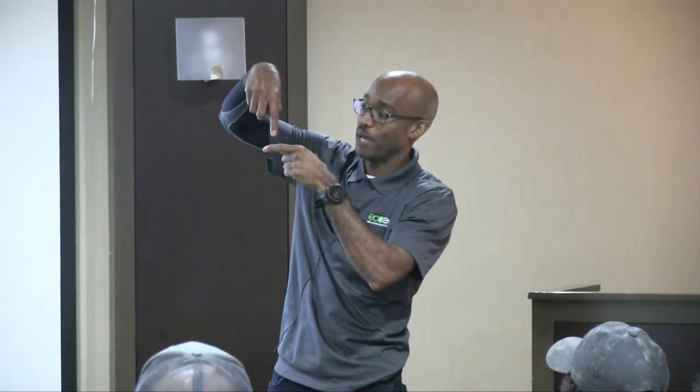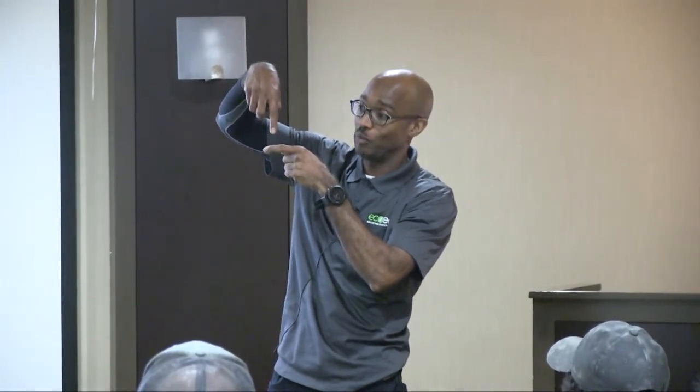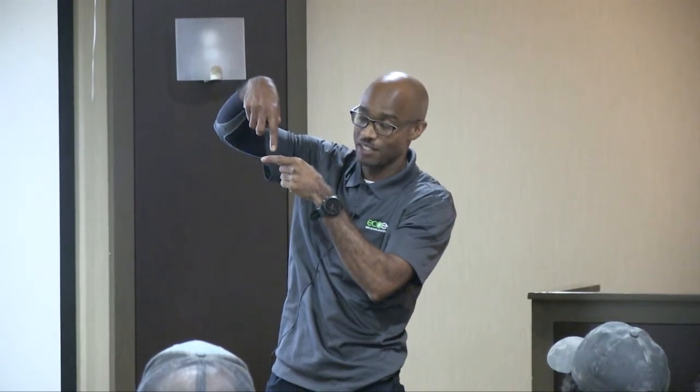The reason why it's key is because unless you're buying a TXV that is sized to that particular coil, you don't know what the minimum or maximum opening is for that, if it's fixed, right? Because even with a fixed TXV, the diaphragm, how much that metering opens and closes, you can't change it. So if the maximum opening is this, it's only going to open here. If the minimum opening is this, it's only going to be here, right? Based on the bulb sensing.